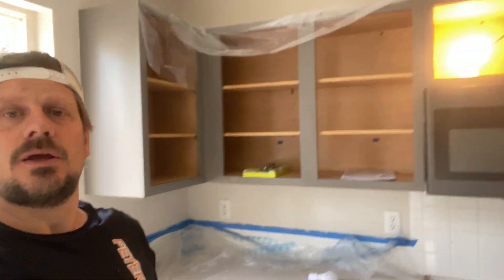You may not have a problem if you don't run things at the same time, but the minute your wife puts a crock pot on there and does bone broth for 13 hours — like mine does — you're going to pop that breaker again and again. The more you pop it, the more you wear it out, and you could actually hurt your panel.